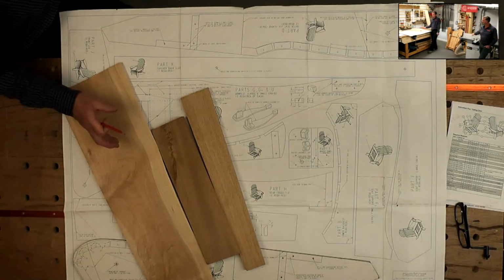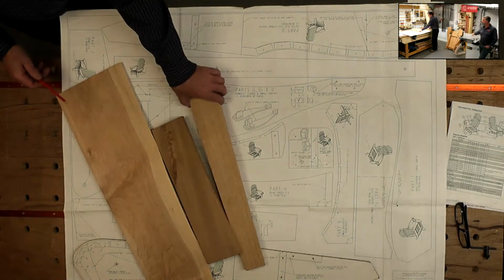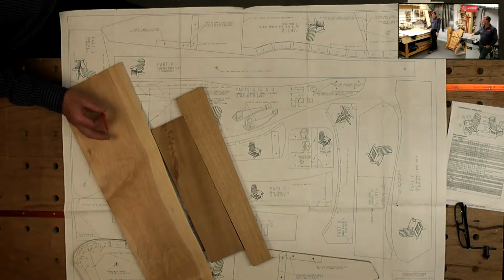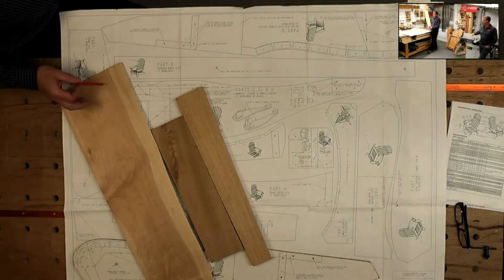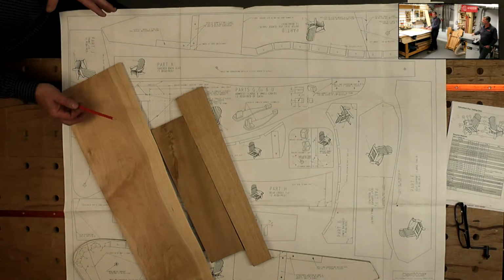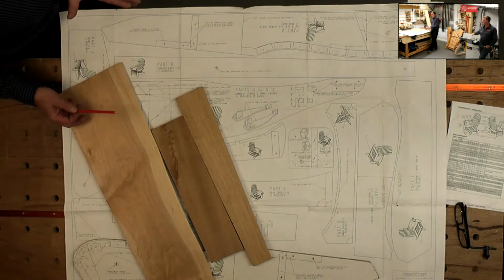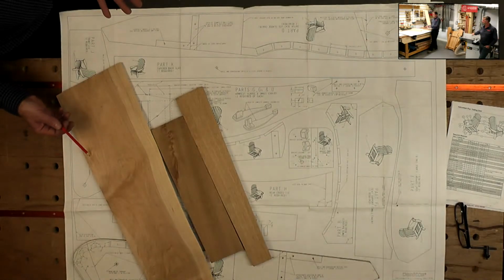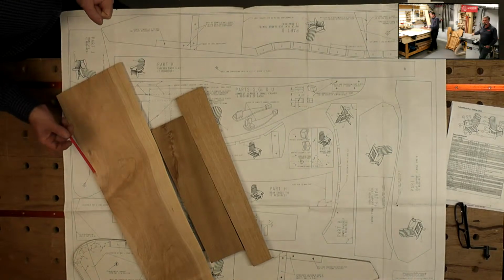And out of all the materials I'm showing you, probably the best. It will last better externally. English chestnut. That's sweet chestnut, not horse chestnut. Sweet chestnut will last longer again. Quite durable. Now you could make them in whatever you want, but think about the weight of it. It's one component when done, so it's quite a bit of material on this. So if you use English oak, which yes, it will last forever, but it's going to be heavy to lift and move about. So that's something to bear in mind.